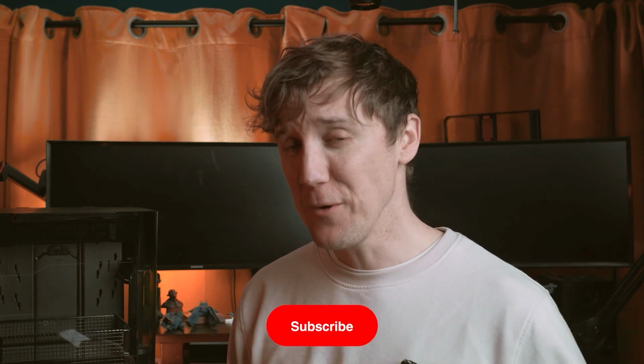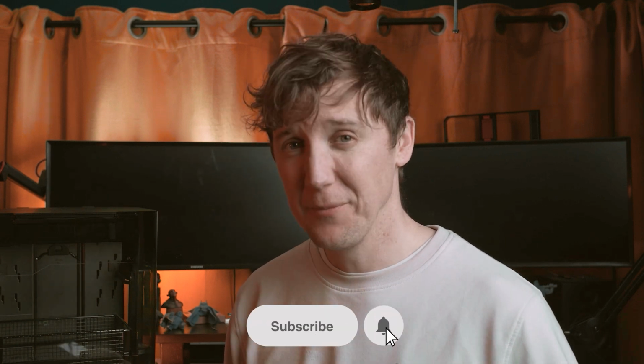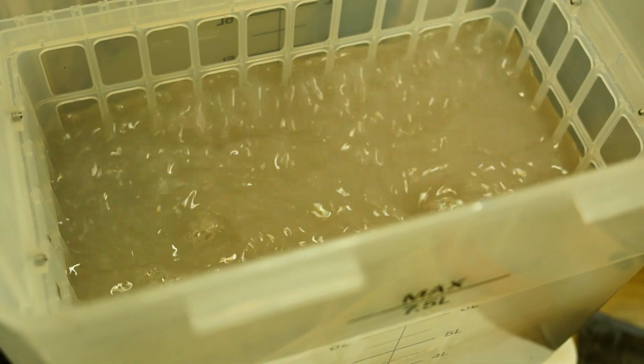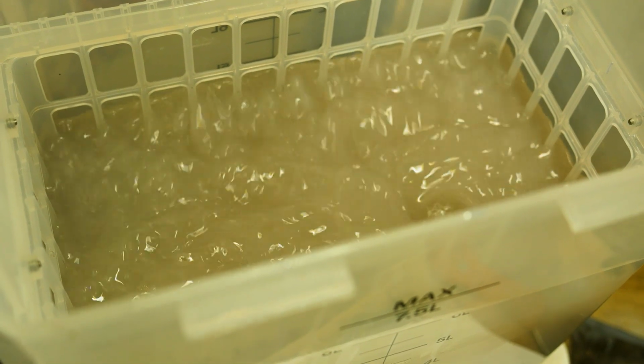Now you've let it drip though, you can move on to the next step, which is wash number one. And now in the ideal situation, you want all your wash fluid to be absolutely pristine. But we live in the real world and we don't need to do that. So we're just going to do that first wash in some old, dirty IPA.